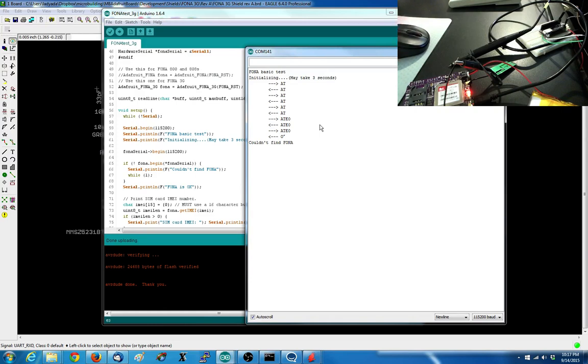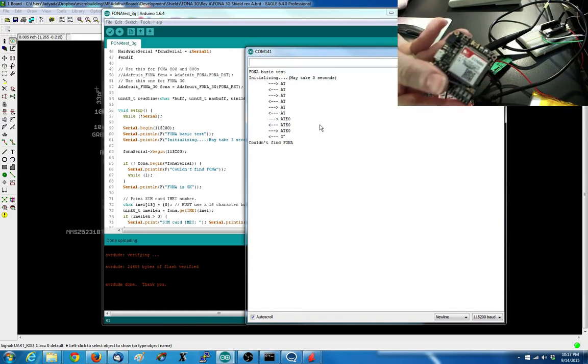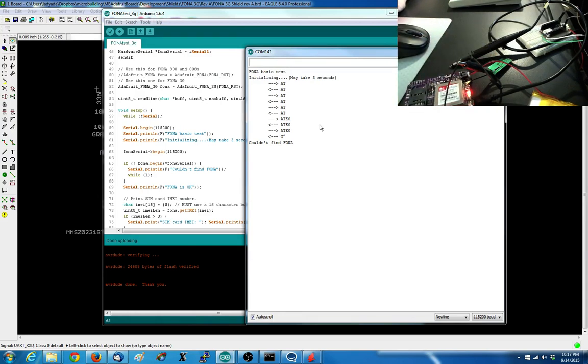So yeah, the chipset for the Fona 808 like this, and the Fona 800 has auto baud detection. So if you start talking to it at 4800 baud and you send AT commands, it knows, oh, I booted up and the first thing that you sent me was AT. Yeah, but at like 9600. I remember when modems started doing that. You didn't have to tell what you wanted. Yeah, it's cool. So the Fona 800s and the 808 do that because they use the MediaTek chipset, and MediaTek does a really good job with chipsets. So the Qualcomm chipset that's in here, and Qualcomm owns all the patents for 3G, so you have to use Qualcomm. They don't do auto baud.